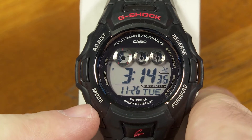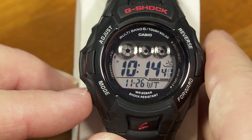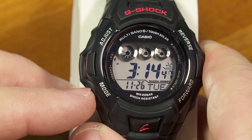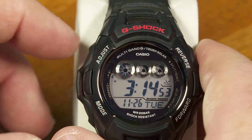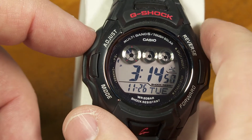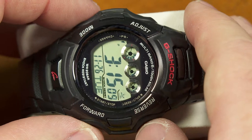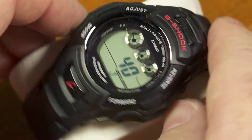If I were to press one button slightly before trying to press others, I would change modes. You've got to think it through if you're going to press multiple buttons at once so you don't press one too early and not get into diagnostic mode. I try to choose something like the adjust button — you can push this and it takes a moment to react, so maybe I push this first and then push the others. Okay, I'm going to press every button except A — and it worked.